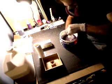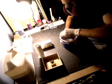So this needs to be mixed very slowly, because as you introduce air into the mixture, those air bubbles show up when you're molding, and air is the enemy. Air and moisture are the enemy to mold making. You produce air bubbles, which you definitely don't want. Pot life is about 45 minutes, which I don't intend to spend the entire time mixing, of course. So I've got a reasonable amount of time in which to get this all homogenized.